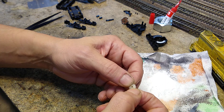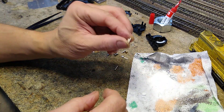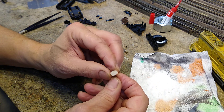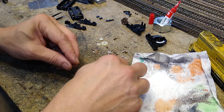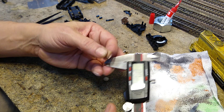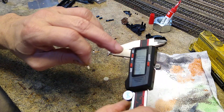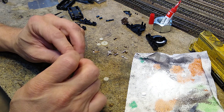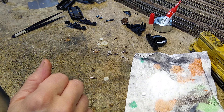Can I move it? Nope. I'd say we have a fixed gear. Now if I force this shaft in... it's a little tight, a little tight for my liking. So you take your caliper, set it on decimal inches, and measure it — 0.0775. If we consult our drill index chart, we'll find that a number 48 is 0.076, a 5/64th is 0.0781, and a number 47 is 0.0785.